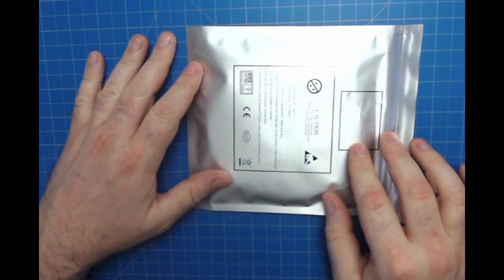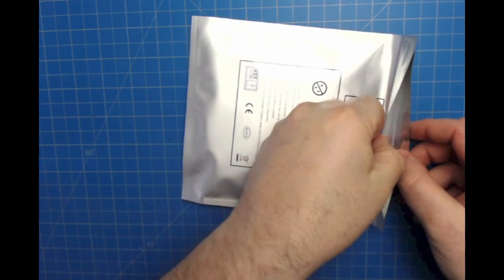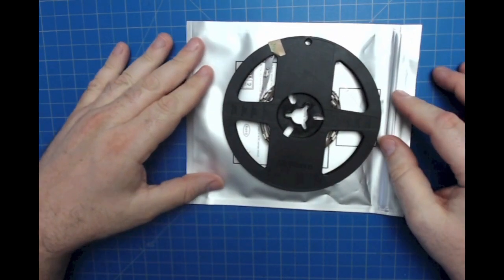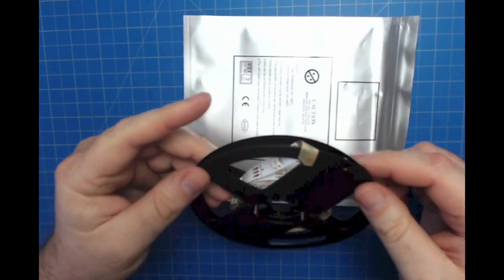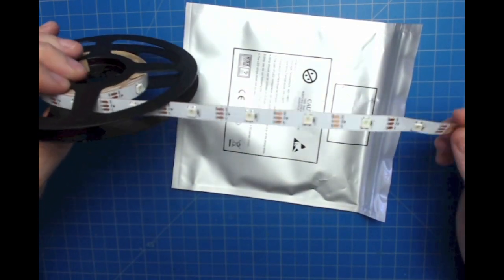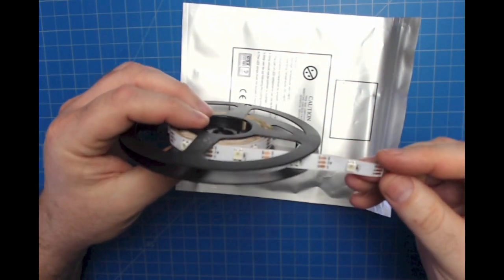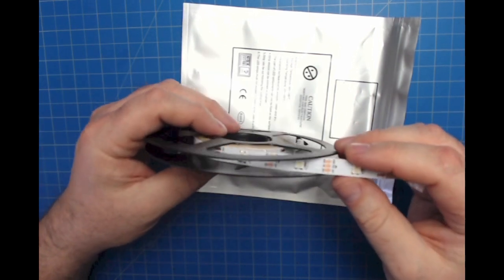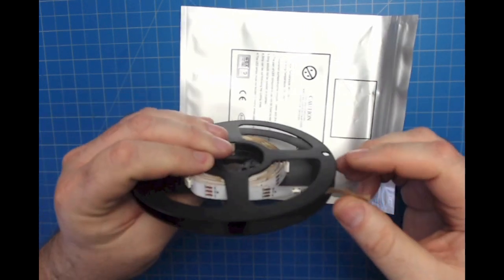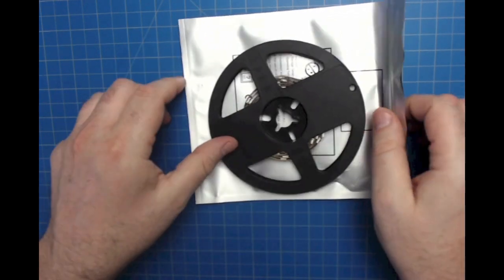We have one silver bag, and there's something inside of it. There is a spool, slightly smaller than the silver bag, that has 60 RGB LEDs on it on a flexible adhesive strip. We've used these type of RGB LEDs before — these are the WS2812. They have a built-in serial interface, and there are several different libraries that can drive these using just one data pin. Pretty amazing.